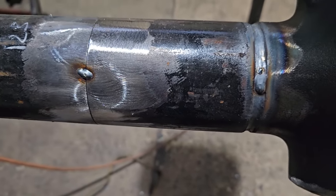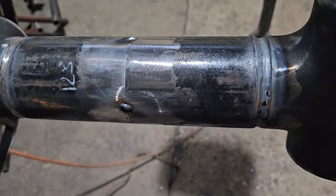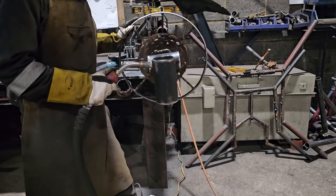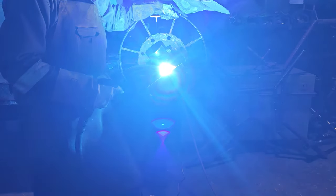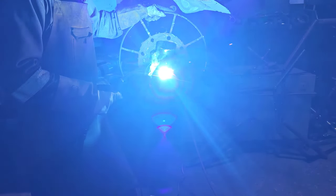In the interest of saving time, I don't grind. And when you grind too much material away, it affects the cap. What I will do is grind down the start-stop. From my understanding of Class 2 welding - I learned this in college - you can basically miss 25mm of root penetration per 100mm of weld. I don't know if that's a rumour, but it's a low spec. Although I definitely weld above that spec, this isn't welded to x-ray specifications because the pipework doesn't require it.